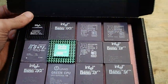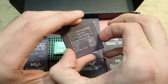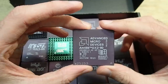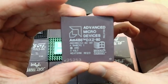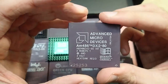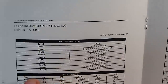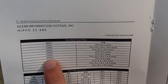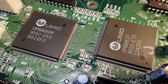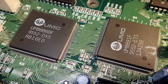For today I decided to change the program and try some performance tests and overclocking instead. Unfortunately I don't have a 486 DX4 or any faster 486 CPUs in my collection. The fastest I have is this AMD AM 486 DX2/80 — a 3-volt CPU with an internal multiplier of 2, designed to run with a front side bus of 40 MHz. Fortunately this CPU allows setting the multiplier to 3, and the Octek Hippo 15 supports multiplier switching and FSB speeds of 25, 33, 40, and 50 MHz. The 486 mainboards based on this UMC chipset belong to the fastest 486 boards out there, and most records were made on boards similar to the Octek Hippo 15.